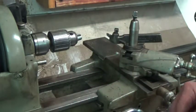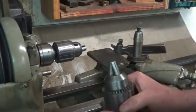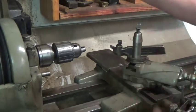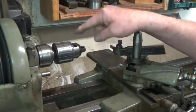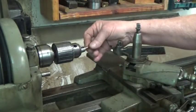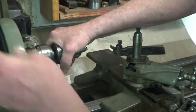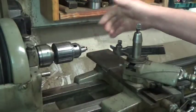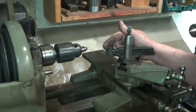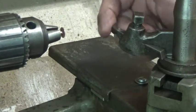So all I do on the lathe here is, now this headstock chuck, the Jacobs headstock chuck, it won't screw down tight enough to grip this post. So that's why I put this, which is just the tailstock chuck out of my big lathe, which happens to have a number 3 Morse taper. So I just stick that in there, and for light work like this, I don't even need a chuck key for this. I just hold the countershaft, tighten that by hand, and this tool, I have ground this tool especially for this job, and I've honed it. It's high-speed steel, and it's pretty darn sharp.